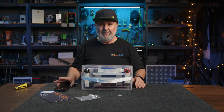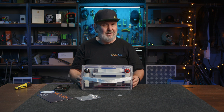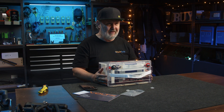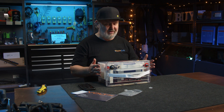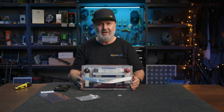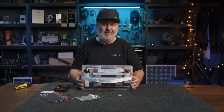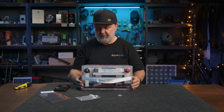Something to be aware of with lithium-ion batteries is that while they can be discharged at pretty cold temperatures — some down to minus 20 — when you recharge them they generally want to be at warmer temperatures, definitely in the positive range. So putting this out in the snow and trying to charge it, it'll probably just sit there waiting for it to warm up. Lithium batteries like to be at a comfortable temperature, typically above zero, sometimes even a bit higher, before they'll charge.